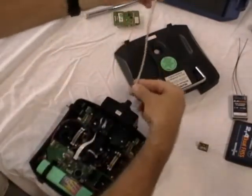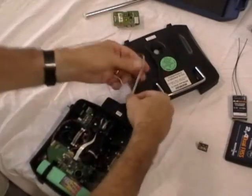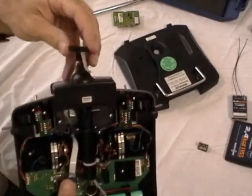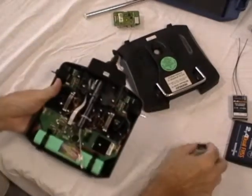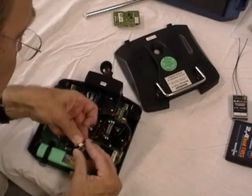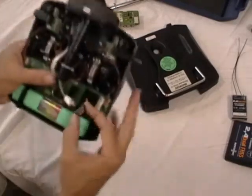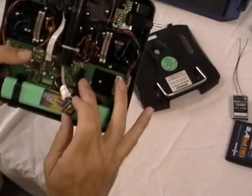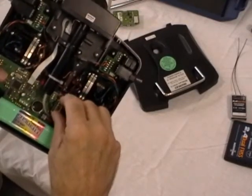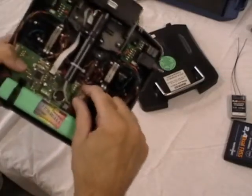First, take the wire - it's got a little label on it that you can snip off, it's just a serial number. It slides right down through the antenna tube and comes out the other end. Now I'm going to plug the cord into this; it's keyed so it'll only go in one way. Make sure it's fully seated and when it is, you'll hear a little click. This then plugs into the module board - watch your antenna wire, just feel where you line up on your pins, and seat it gently without forcing anything so you don't bend the pins.